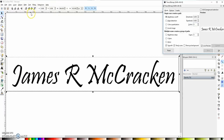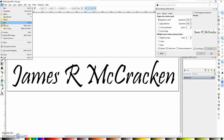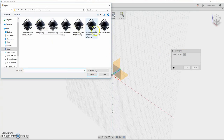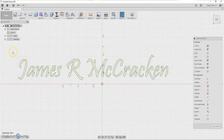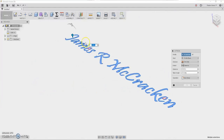It was converted from a PowerPoint slide to a screen capture. Then using Inkscape I converted it into an SVG, or scalable vector graphic. With that I was able to import it into Fusion 360, where I turned it into solids and did the rest of the CAM work.